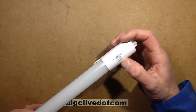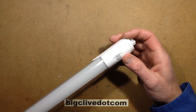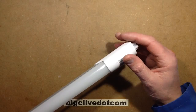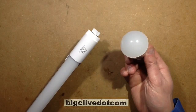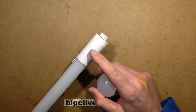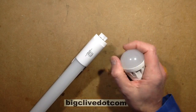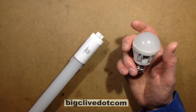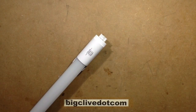This one's interesting because it's also got a radar detector built in. I thought it was just going to turn it on and off, but it actually changes intensity - from 19 watts when detecting movement down to 3.5 watts when not detecting disturbances. I used another radar lamp in the same room, and they did not interfere with each other, which is useful to know.